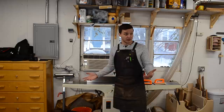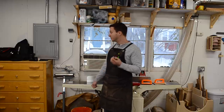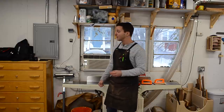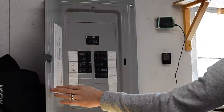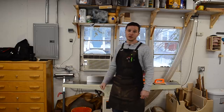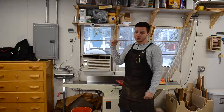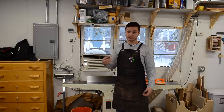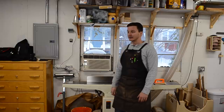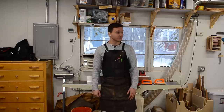In terms of fixes to the garage, besides putting in the insulation and sheathing — which was the biggest improvement — the next best decision I made was adding a ton of electrical. This is a totally separate subpanel; I had to dig a trench through my backyard to connect it to the main panel in my basement. I was really sick of constantly blowing the fuse all the way in my house and having to run back and forth. I paid a professional to do it — well worth it. I installed about 10 new outlets, including 220 volt.